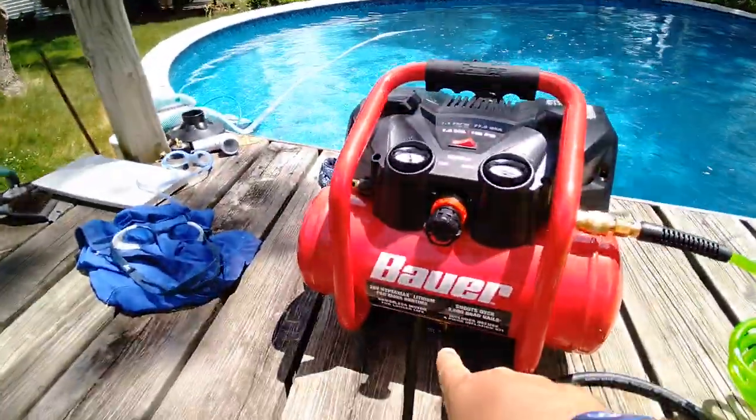That's a little taxing, but if I could just stay down here, then even with my last couple of breaths on the hose on this regulator, I'll start to feel it. It's gonna start fighting. It's gonna be hard to pull in. Then it's time to come up and actually swap batteries. That's when I know I'm running out of batteries and the compressor is not able to keep up. It's not able to fill the 1.6 gallon tank here.